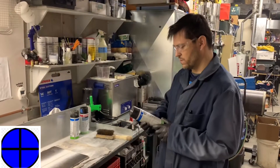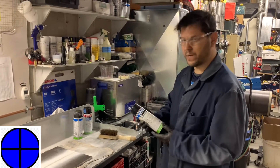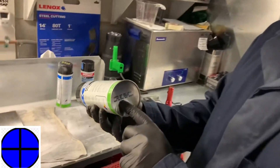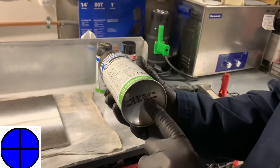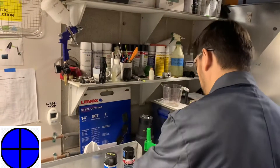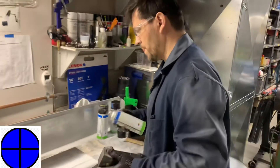We're going to use the 7HF prepared bath — the particles are mixed to concentration and it's done by the factory. You have the batch numbers always on the bottom, which you should be noting on your reports. At the end of the day, keep it shaken up and make sure the particles are dispensed thoroughly through the mix.